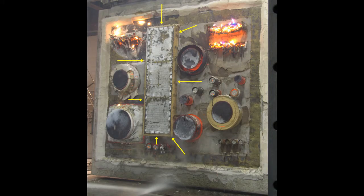Here you have a through penetration fire stop test. Again, nothing wrong with any of this. It's lovely. The same duct you just saw, the uninsulated duct, at the point of through penetration, however, is insulated. This one here chooses rock wool. That's fine. Nothing wrong with that.